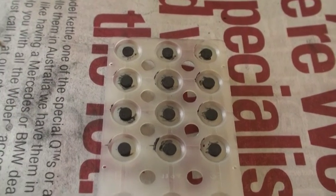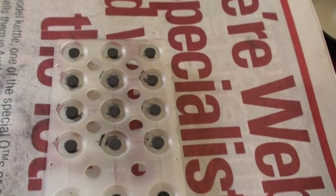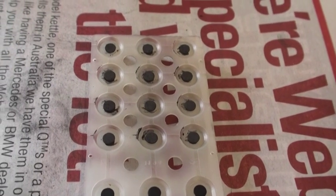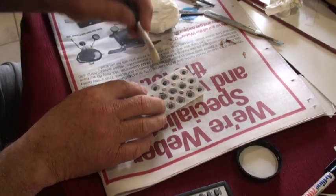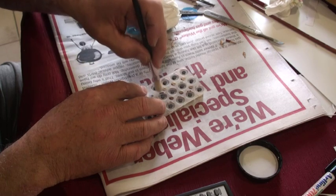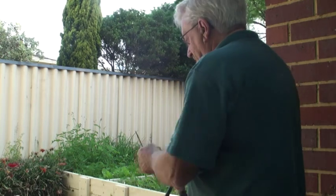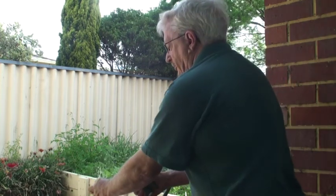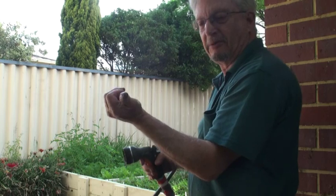If you look closely at my repair, you'll see I've got black on quite a few areas which are not on the button. That needs to be cleaned off because it's quite conductive and it could short out the keypad. So I'll clean it off with a paintbrush and a bit of tissue. Very important: take your brushes and your little bottle outside and clean them with a garden hose. If you try to do it in the sink, you'll make the wife very, very unhappy. It washes out in water, but it's also very, very messy — you'll get a fair bit of stuff on yourself as well.